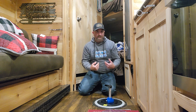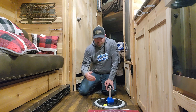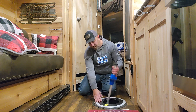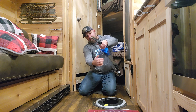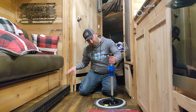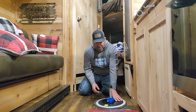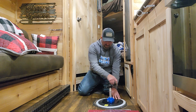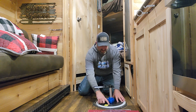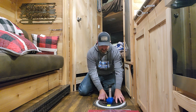In this setup I obviously don't have the transducer on the pole, but as far as how the cord will come through — you're going to secure the transducer cable below the cover to the pole. You'll run the cable down through our notches for the electronics to your unit, then tape it or velcro it to the pole. That gives you two options: you can either spin it on the base, or you can tighten the set screw and spin the cover instead.